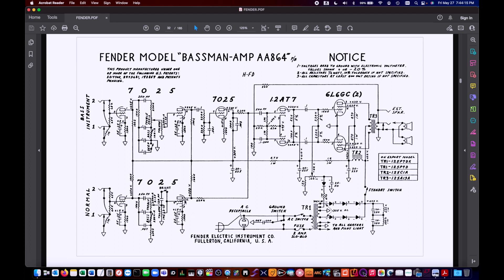The normal channel only has two stages — a standard input gain stage, goes through the tone stack, then through a recovery circuit, and then through another 220K mixing resistor. They mix together and go off to the power section. It's a fixed bias amp, very simple and straightforward. The part I most like about this amp is the preamp, and I'll show you why when we look at the AB-165 circuit.